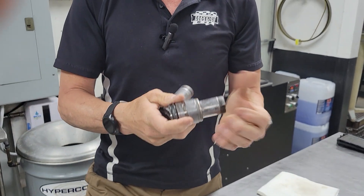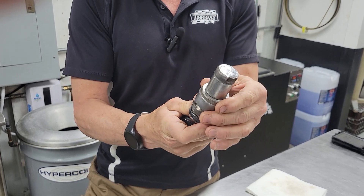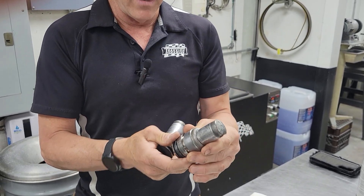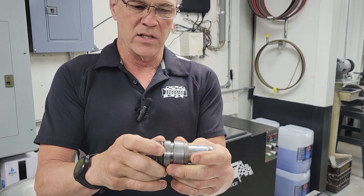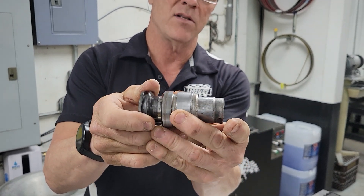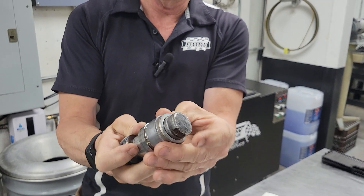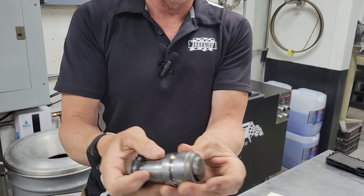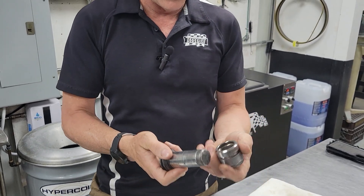Because your bucket is getting pushed and pulled with tremendous force on this, the bearing itself wears out. This thing is incredibly wiped out and sloppy, and because of that, it accelerates seal wear. Every time the bucket is torqued one way or the other, this extra mechanical slop is just bad. This is so worn down that as soon as you retract it in and it goes past the first seal, it's not even hardly touching anything anymore. It has to retract this far to get your implement off, and it's just rattling — there's no way it's going to hold oil, never mind oil under pressure. The seals and all this have failed.